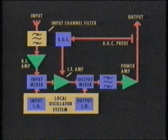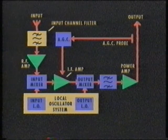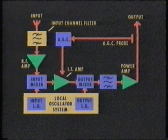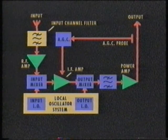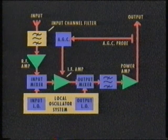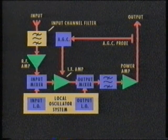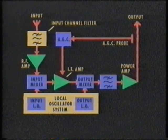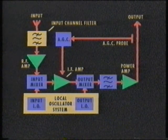This signal is not demodulated down to a video signal, since this would result in further signal degradation and equipment complexity. The IF amplifier stage would normally include some form of gain-frequency correction, which can be used to ensure specified vision to sound power output ratios. Frequency translation of the IF to the output channel occurs in the transmit mixer, which is supplied with the transmitter local oscillator.